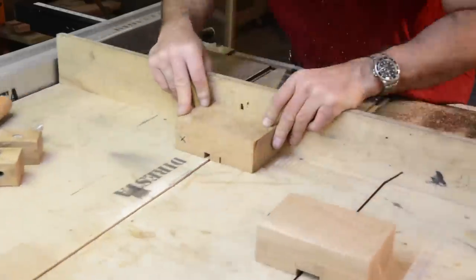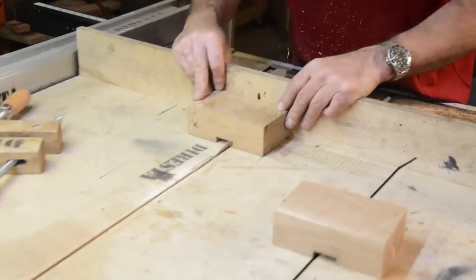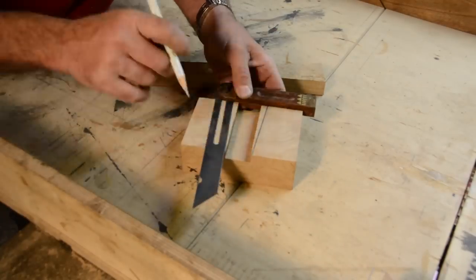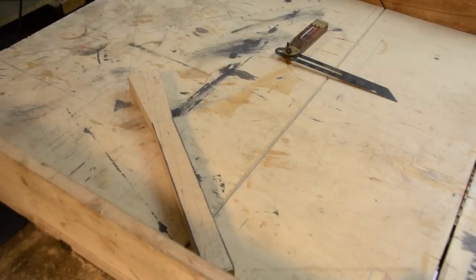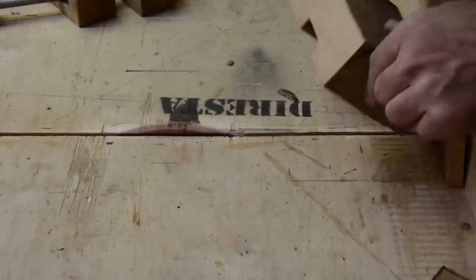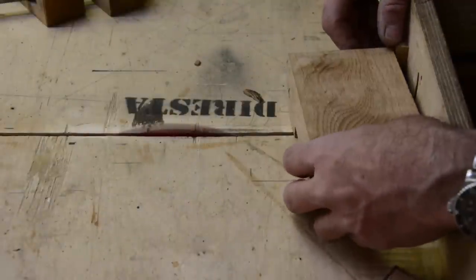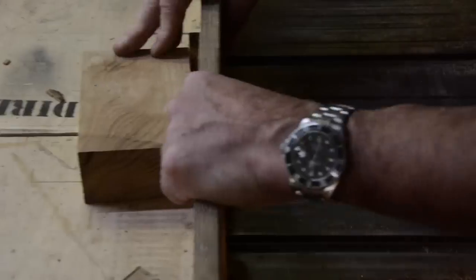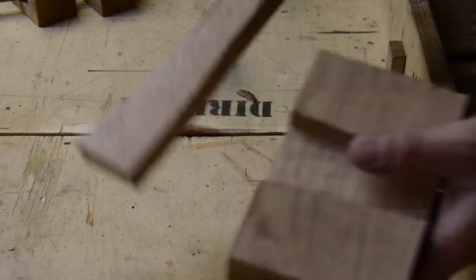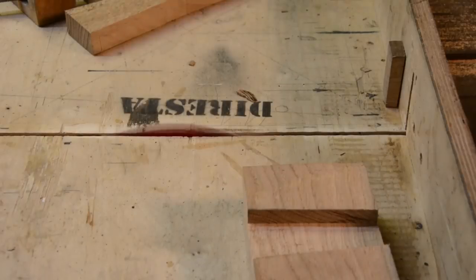I'm making a perfectly square channel down the middle of the mallet head by being able to get into it on either side, so they're straight. Then I'm able to geometrically make the accurate taper. I'm using the sled and by putting a chunk of wood under one side - I made sure I knew the size of the chunk - I'm able to kick it up to the angle I need, then use that same chunk for the other side. I use the cut line in my sled as a guide so the marks are visible on each end, then I do a test fit.